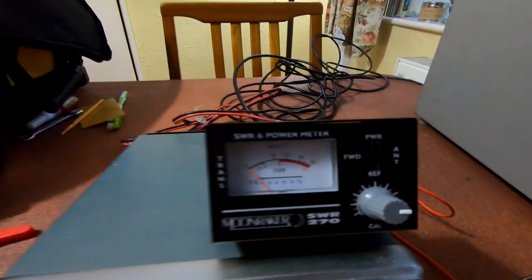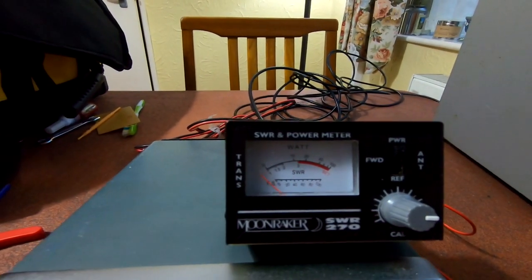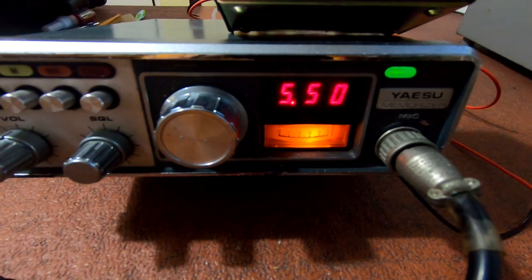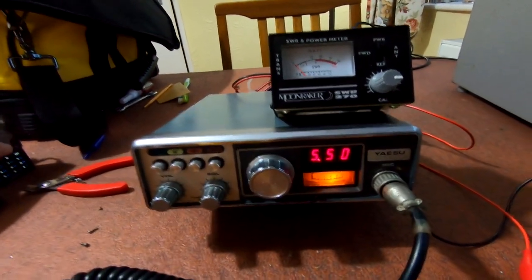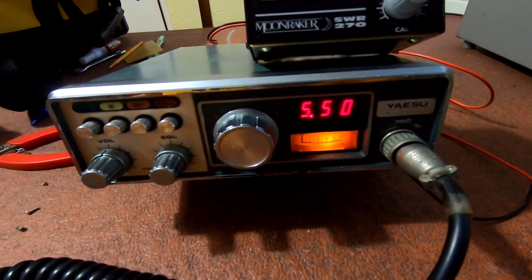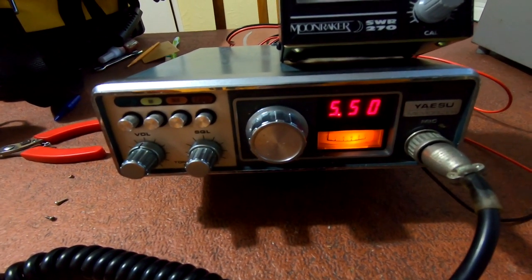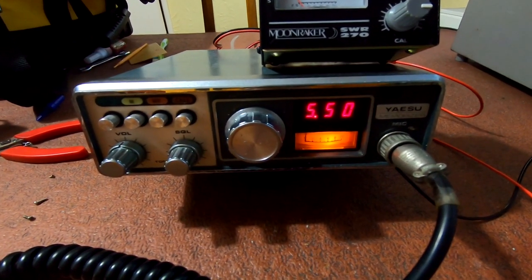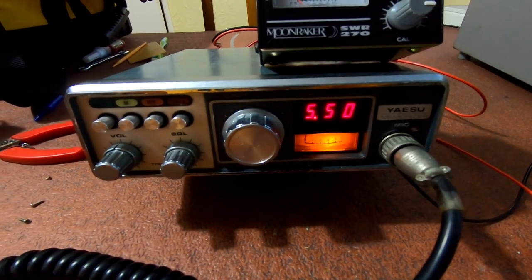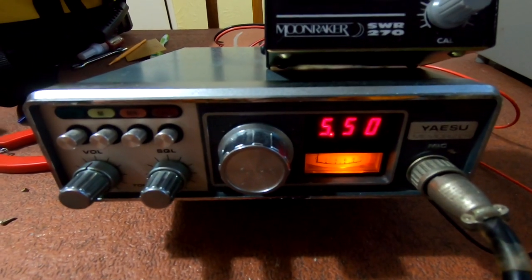A bit of output on high power too. It appears the radio is working, and of course it receives alright. One, two, one, two. So it looks like we've got a working Yaesu FT-227. The only thing I'll need to do now is get it on a spectrum analyser to make sure it's dead on frequency and not splatting across other bands, because I don't want to go out and use it without knowing. Anyway, that is my novelty repair of the Yaesu FT-227 — till next time, thanks for watching!